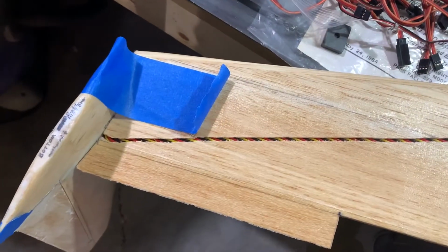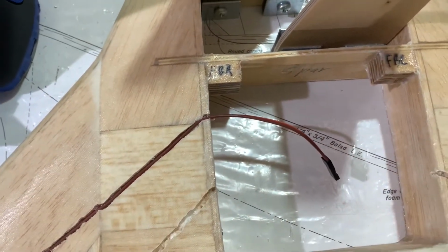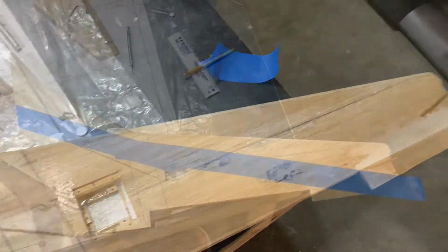All right, friends, we're looking at the bottom portion of our right wing, and you can see how nice and neat we've got our wire tucked in our channel, and we've got just enough extension in the middle so that we can attach an extension once the wing is attached to the fuselage. All right, we're going to go ahead and focus on the left side, and more to come.